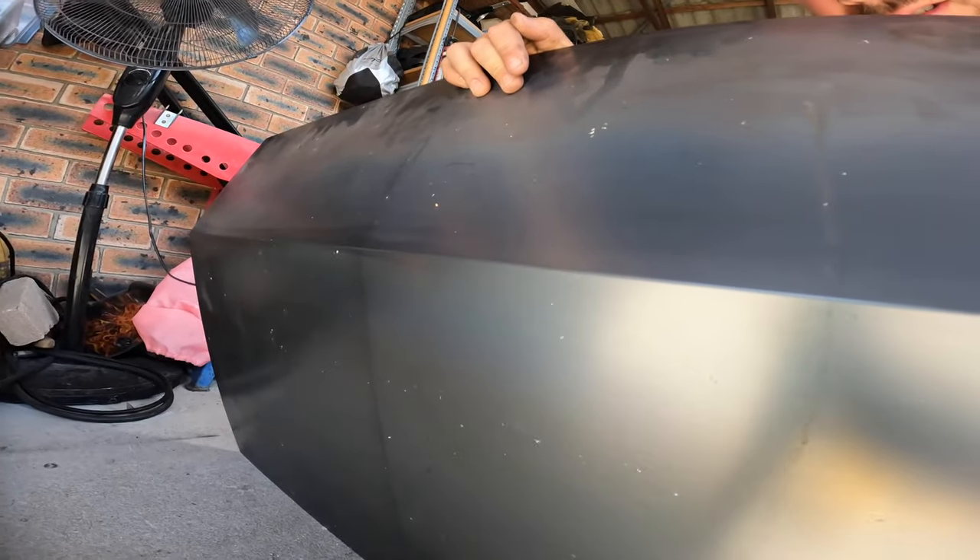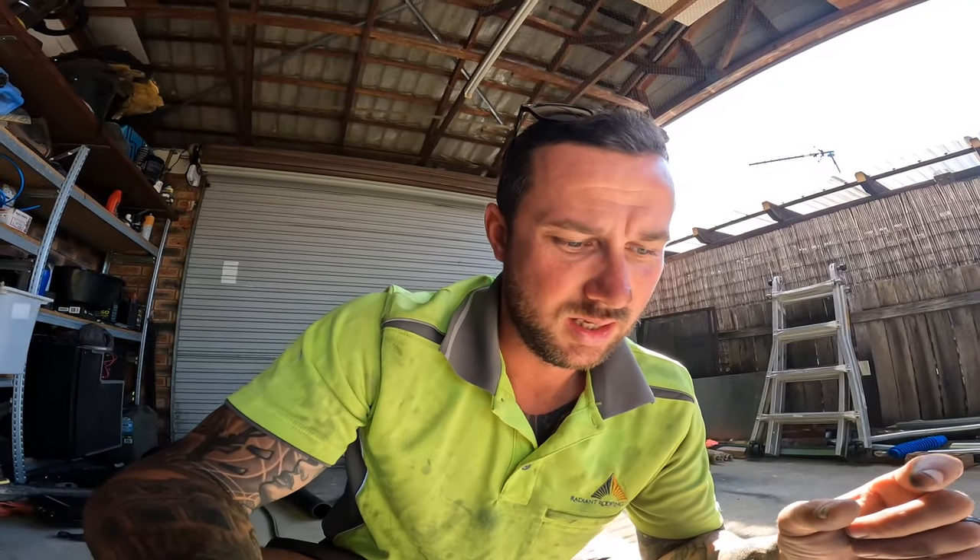Since I don't have a folder, what I'm going to try is putting a grind line nearly all the way through on the inside and then bend it up. I just did my first fold — if you wait till you see how good this fold line is, you'd honestly think it came out of a proper folder. People will say it's weaker because I'm grinding it, but once I fold it to my desired pitch I'm going to tack it on the inside. I just stood on it and pulled it up to the desired angle until it touched the other side.